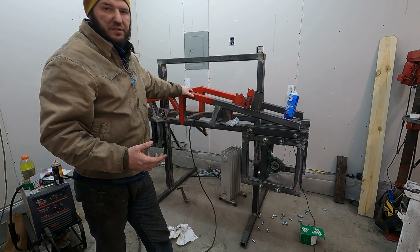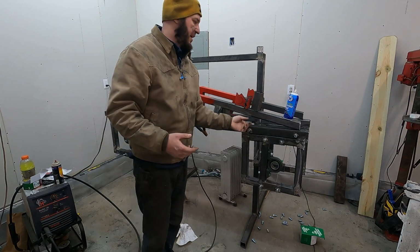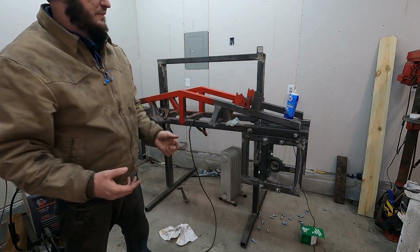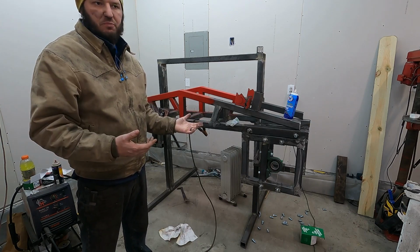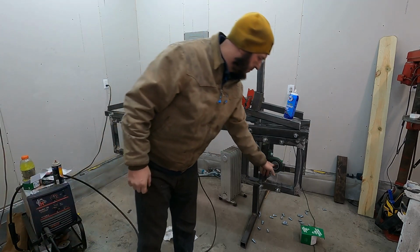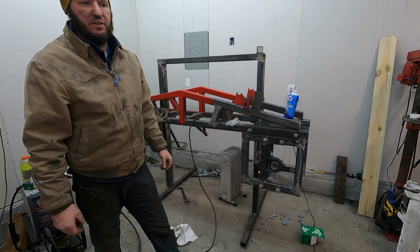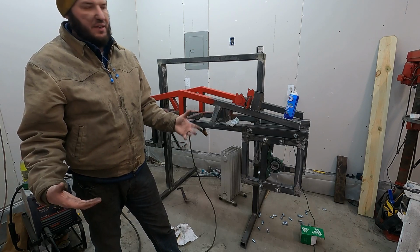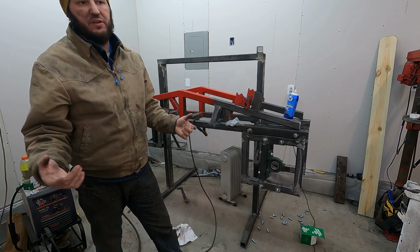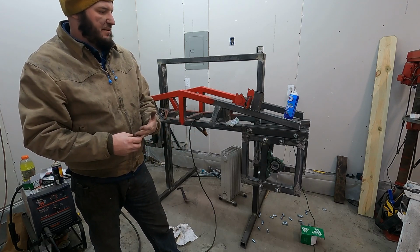I've seen a lot of pulleys out there secondhand that are 19 inch to actually run the band on. Because eventually, if this goes real well, I'll upgrade to band wheels. Currently, I got 2-inch pillow block bearings, because when I looked at the website that makes those bandsaw wheels, they recommended from 1.5 to 2.5 inches. So I figured if I was right in the middle, that'd be best.